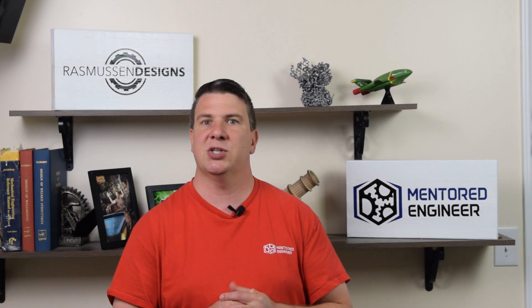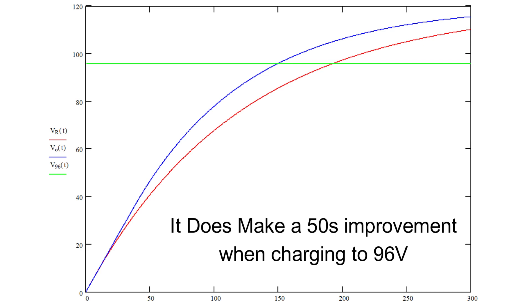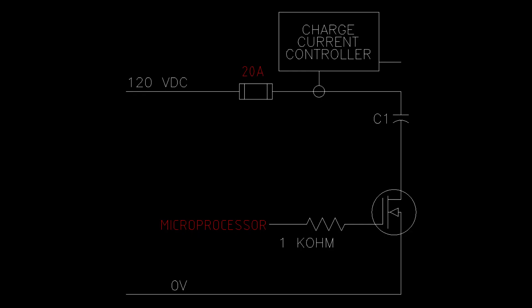Let's see if we can find a happy medium. We could change the resistance - as we charge the thing up we can decrease the resistance. But these resistors are taking a lot of power so they'll have to be very high-wattage resistors, and we'd need to turn some on and off as we go through the charging process. That requires a control system that monitors the current and tells me which resistor to turn off at which time. Not the direction I want to go. So what do we do? I'm going to take out that resistor completely and put in a transistor instead. This transistor is going to operate on a PWM signal coming out of a microprocessor.